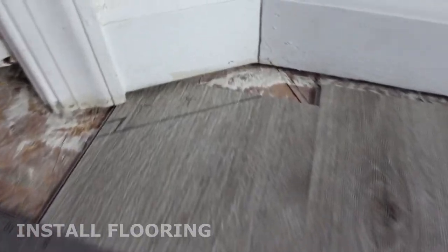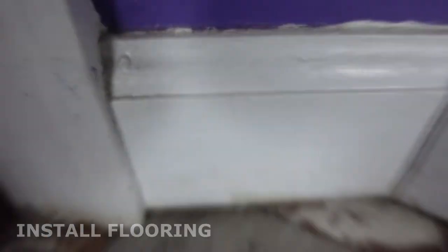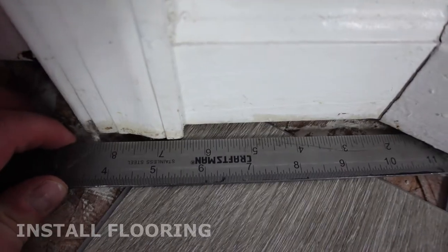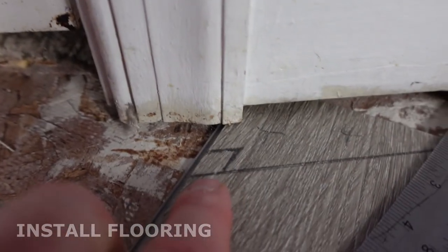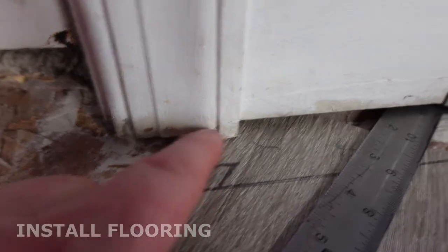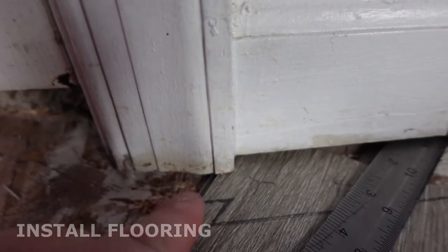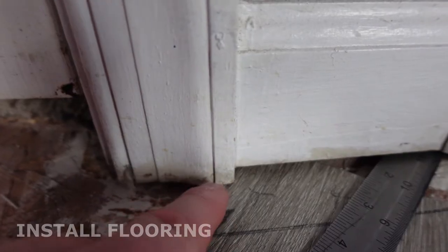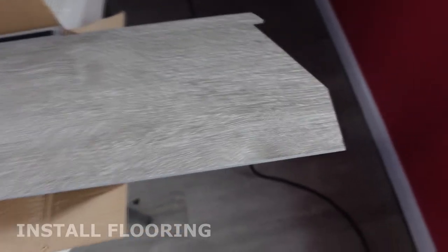All right, we're at the part of the wall where it is angled. So you basically get this board slid in as far as it will go. And then I just took a straight edge here. And as you can see, I marked that cut. And then because the baseboard actually ends sooner than the board, I'm gonna leave that little notch there to cover the gap under that molding. Quarter round is only gonna go up to this edge here with the baseboard. It is not going to go across there. So you wanna make sure you don't have any gaps exposed around this molding, because you're not gonna be putting anything around it.